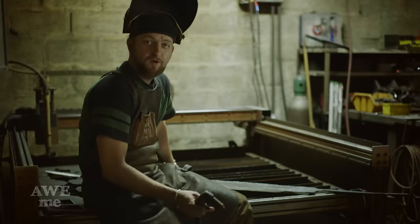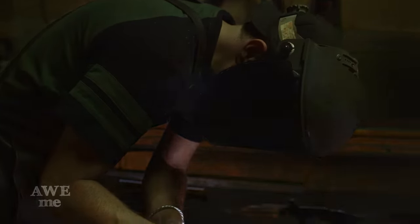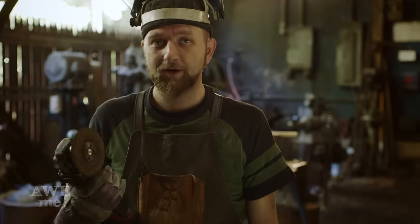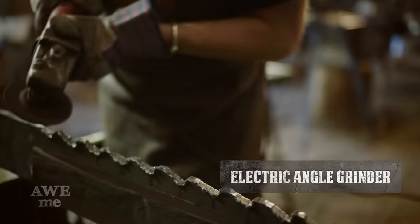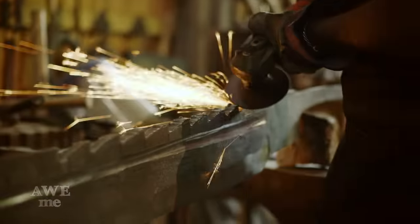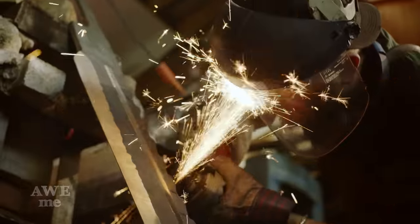Now that my fuller's ground in, it's time to start on the serrations. Normally I would just grind these in but I'm pretty tired after all this grinding, so I'm gonna use the hand plasma to rough in my notches and then move to the grinder to true everything up. Now that I've roughed in my notches on the back of the blade, I'm gonna go ahead and true them up with a hand sander. The difference between hand grinding and using the sanders like I usually do is I prefer to move my work to the wheel — in this case I'm moving the wheel to the work.